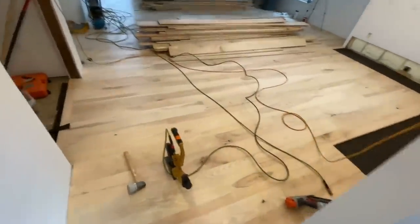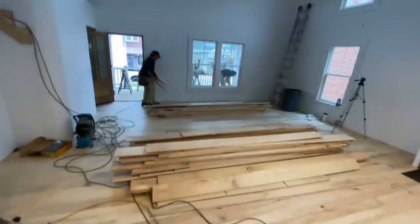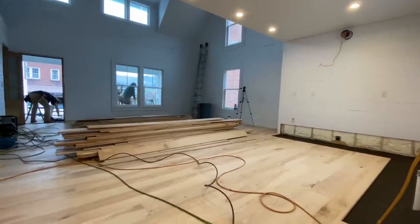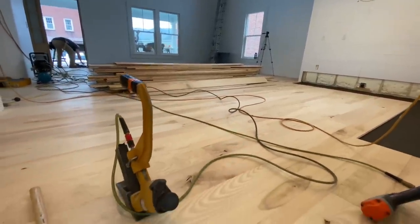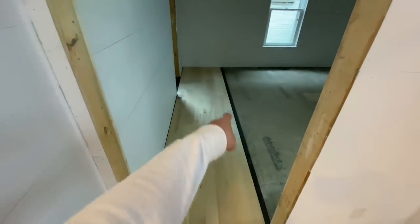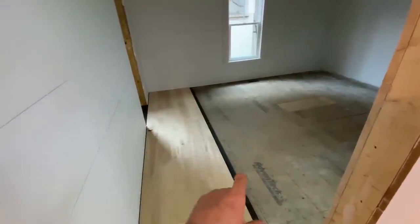It's been four hours - we started at eight and it is now twelve. We have all of the living, kitchen, and dining area done, starting into the entry hallway from the back, and some of this one bedroom. I need to make a reverse strip right here to change the direction of travel and nailing. I'm going to take enough wood home and mill a piece that has a double tongue - it'll lock into this, lay down and get nailed back that way, allowing us to reverse.